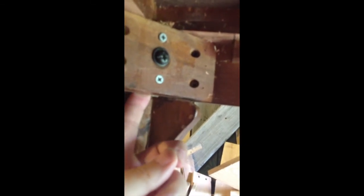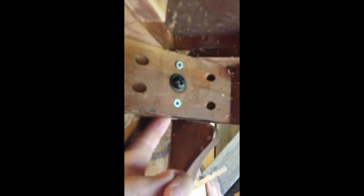One of the issues that I had tried to address with the legs, if you remember earlier, they were shaky. I was having a hard time getting them to sit stably in place, so I had taken the corner section here, that lug nut, or that lug, that cam, and put liquid nails into the leg, and then what I ended up doing was putting washers on this bolt here between the two so that it didn't pull out. And then just as an extra stabilizing measure, I put 2 deck screws into the top and the bottom there on either side.